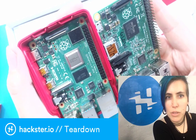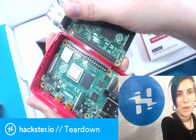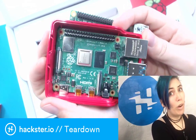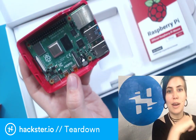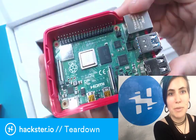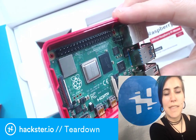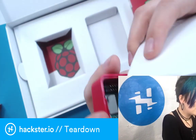About the GPIO pins — it is backwards compatible, and apparently according to Alistair these 40-pin connectors are even backwards compatible with the original Pi 1's 26-pin connector. So you could in theory put a hat you had for that on one of these and it would still work. But you also have four more SPI pins, four more I-squared-C compatible pins, and four other UART pins — so expanded capabilities there.